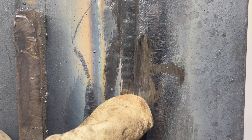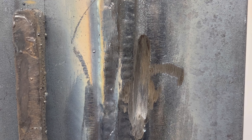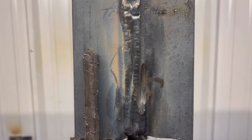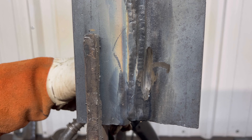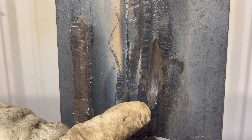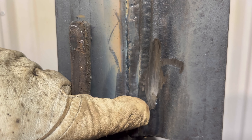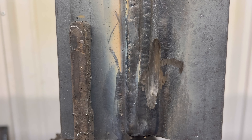All right, we went back and grinded a little more — looks like we got it out. Once that porosity clears up, you want to grind in there a little bit more deep just to be on the safe side, in case there are a couple more. You don't want that to bust the X-ray and lose your job. Right here is a little too deep to cap right off the bat, so we're going to throw a little filler from right here to about right here on top. Once it's flushed, we'll clean it up and start back with the cap.